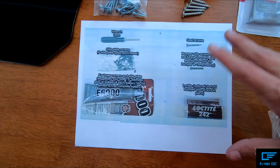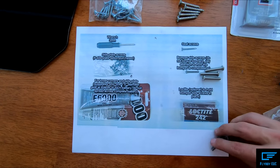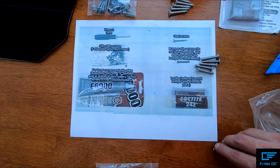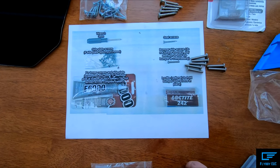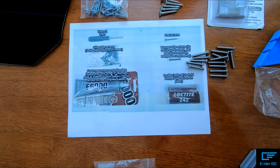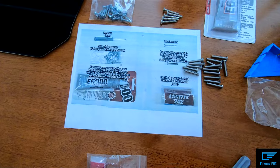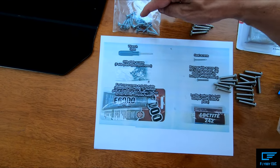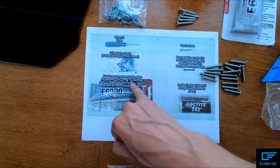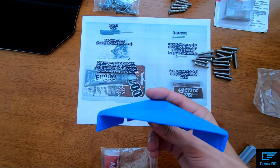So we have our little instructions to tell you what goes where. These go into the bumper side screws - don't torque too hard, pay attention to how the bumper is compressing. With these TPU prints and softer material prints, these need to be snug, but there's not going to be a designated hard stop as you're twisting these. So you want to pay attention to that or else you'll just crush the plastic. We've got our side panel screws right here, and then for the lower corners and side plates - that's what the gloves are for.